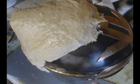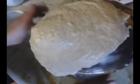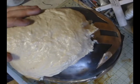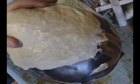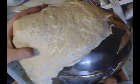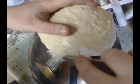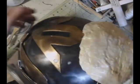All right, so I waited about an hour and a half. I let the Plasti-Paste get fairly dry. I'm removing my piece of Sintra underneath. Now the Plasti-Paste is not fully cured at this point. What I'm doing is cutting those edge pieces off. See the bits around the edge? I want to cut that jagged edge off so that I can make it a nicer, flatter edge, just like we did with the silicone, so that it's easier to pull off the helmet. It's also easier to mold the inner half of the mother mold when we get to that point. It's easier to mold them together and have them sit together if it's a nice flat surface. Also, you can see how using the alcohol and the brush made the surface unjagged and nice and flat there. It's comfortable to hold. But the Plasti-Paste isn't fully cured yet, or else it would be much more difficult for me to cut it off like that.